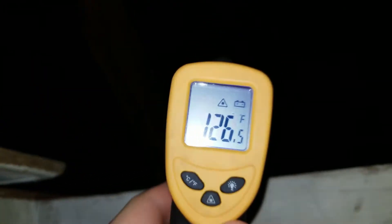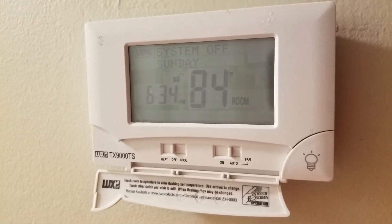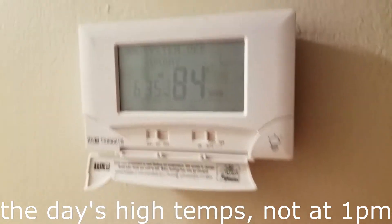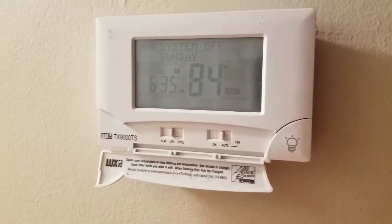Seeing this, I'm definitely going to paint the entire roof, and I'll update again once it's done. Another interesting thing to note is that even with that little strip I did, it looks like it already dropped the temperature of the interior of the house. Yesterday the outside temperature was about 92, same as today, but it only got up to 89 inside in the evening — so there seems to be a big difference.